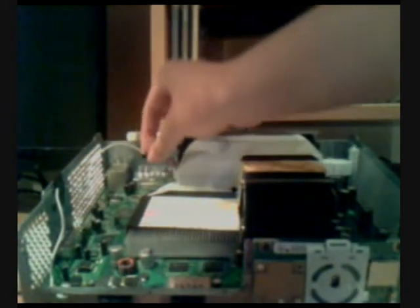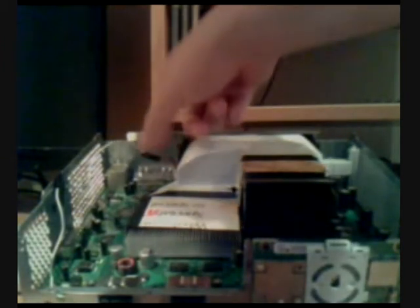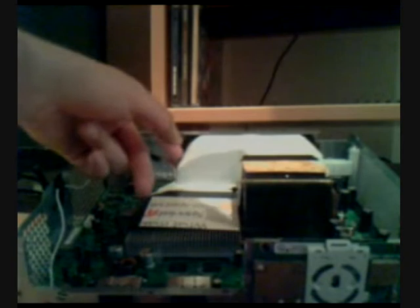What I've done is I've gone online, as you do, and found some tutorials, and this is what you do. You've got your brown, red, blue and black wires. You don't want to touch your blue and black wires, they ground the fans. Whichever fan's not working, you can do this even if both fans are working, it makes the fans spin a hell of a lot faster. They are quite a bit louder, but it's hard to notice with your speakers up, so I don't really worry about that, but they do make the fans spin a lot faster and cool your Xbox a lot better.